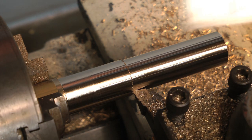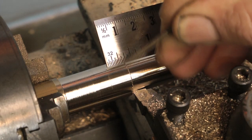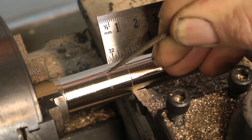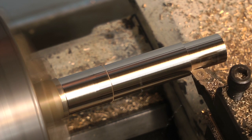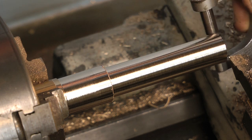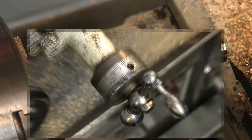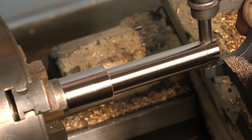Not wishing to waste the brass, I'm actually going to make something I need for a gas burner — it needs to be two and a half inches in length approximately; it's not a critical component. The best way to mark the length is just to use a ruler and scratch the work, because when it's finished you'll turn it around in the chuck and clean off the end anyway. With a knife tool fitted, turn down the bar to above half an inch, checking it with the micrometer frequently — always do this with the lathe not running. As you get closer to the finished size you'll need to use the graduations on the handwheel, whether metric or imperial.